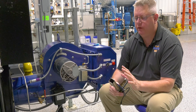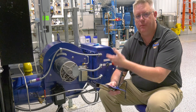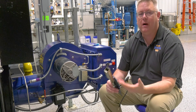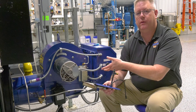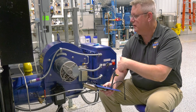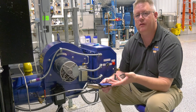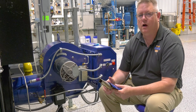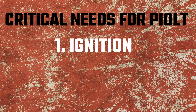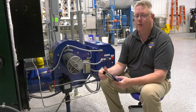We're going to take a look at one of the most common obstacles we encounter in getting a burner and boiler piece of equipment running, and that's pilot problems. To light the main burner we've got to first establish a pilot, verify it, and safely open the main fuel valves. Pilots can be finicky, and the three most important things are that we have a heat source or ignition, we've got fuel, and we've got air — and each of those things has certain challenges.